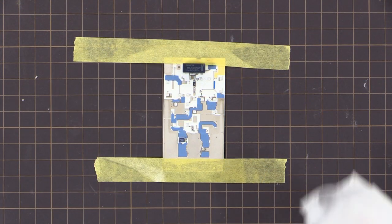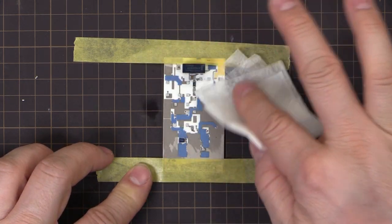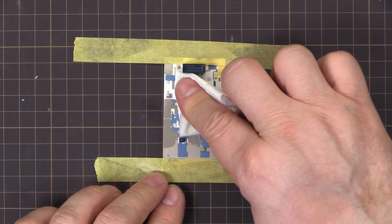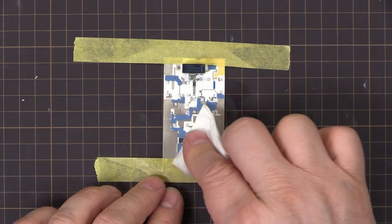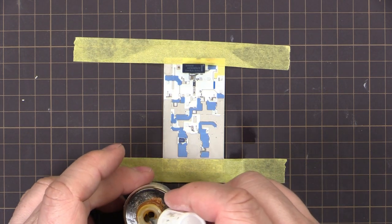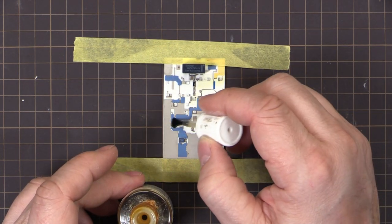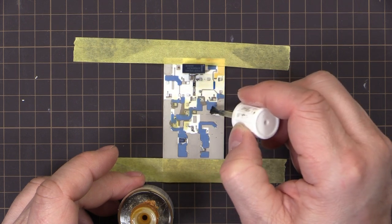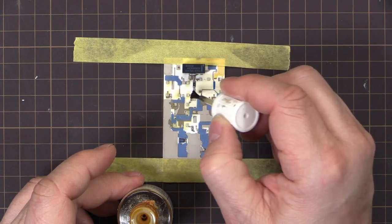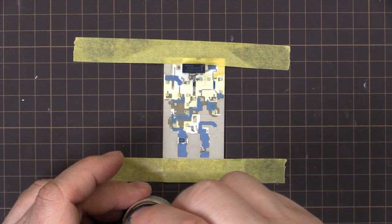All right, so they're all removed. The pads are cleaned up, so now I'm just going to give it a wipe with some isopropyl alcohol - really, really gently - just to clean off any contamination before soldering back in. The new one's back in. Now flux - I'm going to wash all this off afterwards but I'm going to put lots of flux on all the pads. The bigger the glob, the better the job, because I want these to solder well quickly and I want the flux to really do its job and make things happen properly.